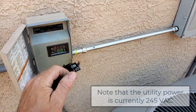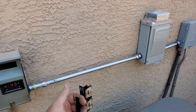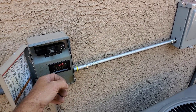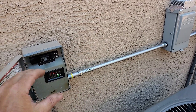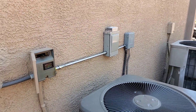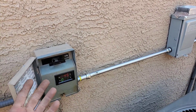What this is, as we were discussing a little in the chat — this is the reason I was trying to make my voltage regulator, which is disconnected right now. Whenever the voltage was at the minimum amount I needed for the VFD to run, I wanted it to basically cut out the utility power automatically, and as the DC bus sagged just enough, it would start bringing on the utility power. That's turned out to be a kind of hard circuit to make, and I need to get back to that.